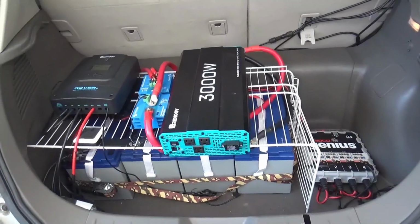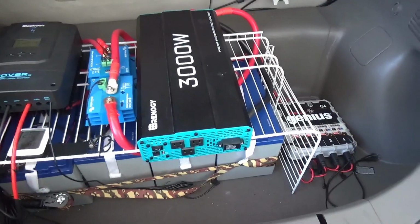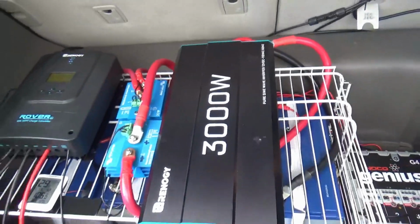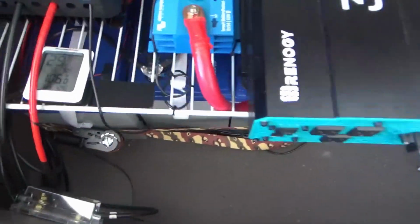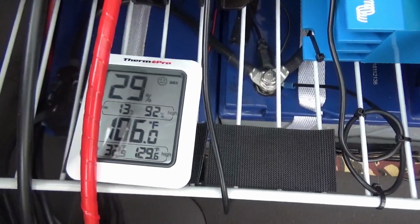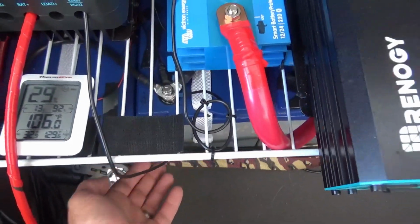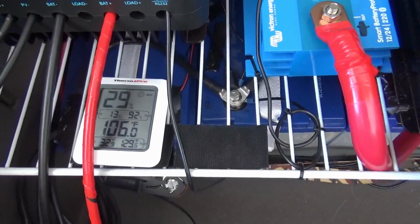So, next question we have to ask ourselves, obviously, is what caused it to die. The voltages applied across it have been at a healthy load the whole time. They've been applied through overgauge wiring, so I don't think under voltage feeding it was the issue. The temperature in the back, although it doesn't run at 129, it really only gets that hot in the car on the weekends when I park it and the windows are rolled up and the batteries in here are recharging. But 129 is still very high. That's our most likely culprit.